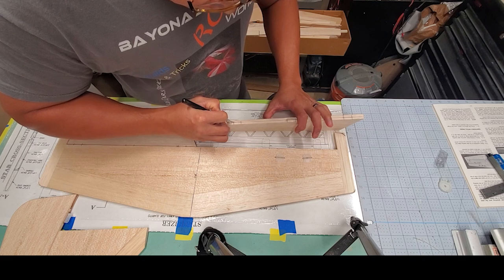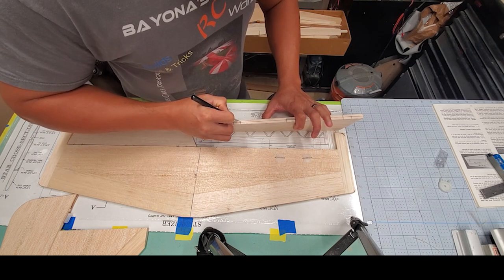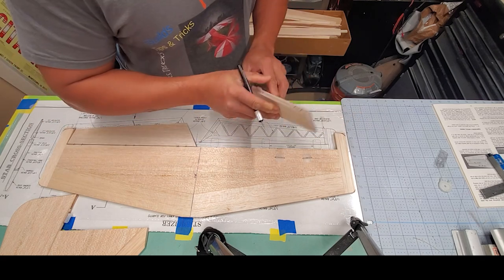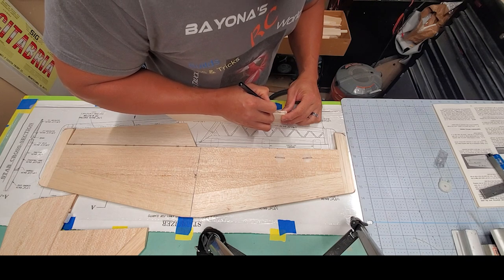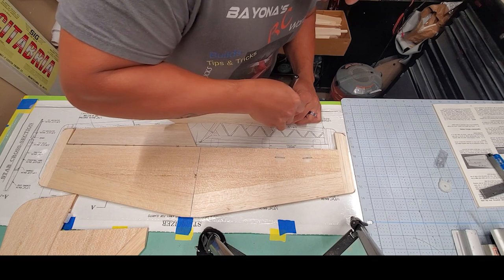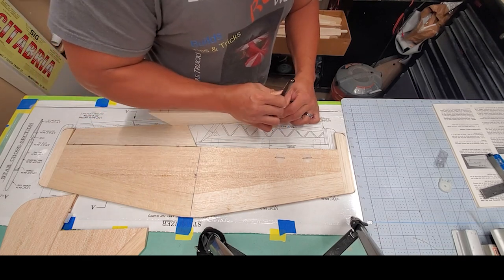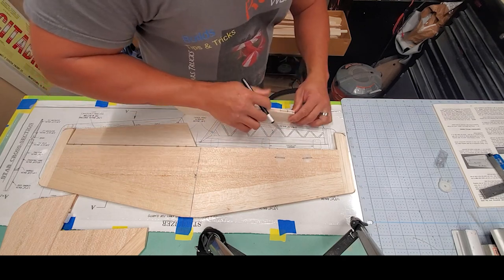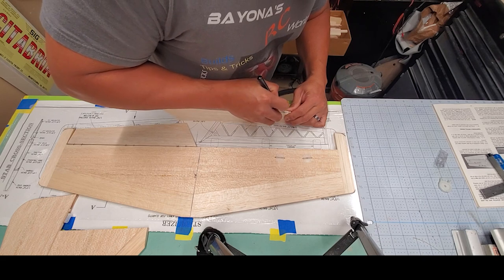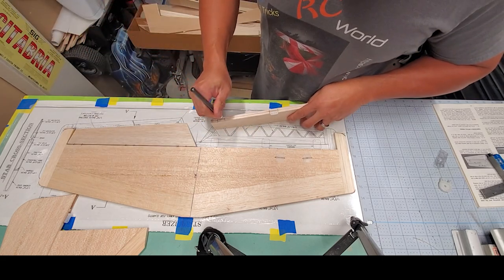As long as this is straight up and down, and my blade is straight up and down, and I just little by little work my way in while putting slight pressure every single time, my blade will always go in straight, or my hinge will be cut nice and straight. But just be mindful when you're doing this, because you can still slip and cut yourself. That's the last thing we need to do, is cut our hands, because our hands are the ones that continue to build. If your hands are hurt, you can't continue your build. Or you could, but it's going to be very uncomfortable.